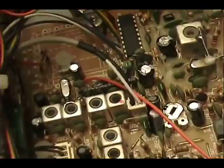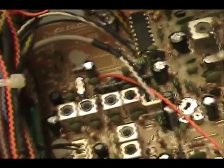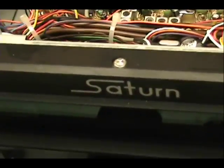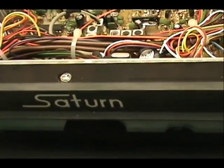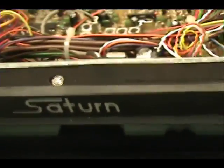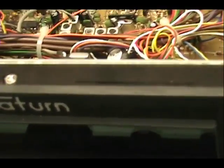You're going to need to let it cool completely down. Then heat the radio — I know it sounds funny — let it cool completely down, because right there it's terribly hot. We want it to just cool back down to room temperature. Turn the radio on, let it sit and warm up for about 20 minutes at regular radio temperature, and then we can do the alignment of the frequencies.